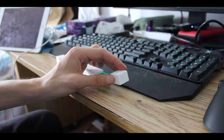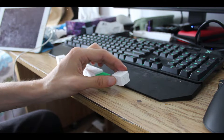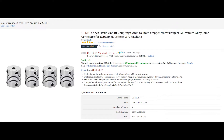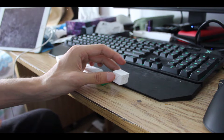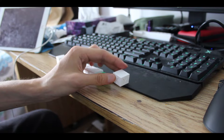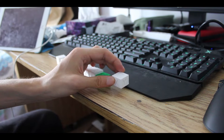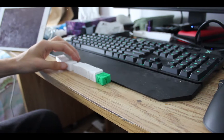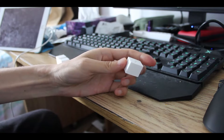Then I thought about exchanging the lead screw. I didn't really exchange the lead screw — I exchanged the Z coupler instead, which was a much easier exchange. So I changed it, but it still had a problem. This cube was printed with the Z coupler exchange and the issue remained.